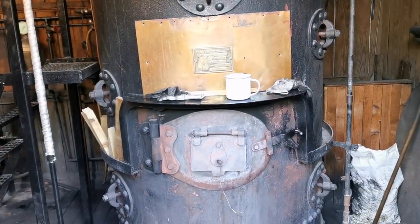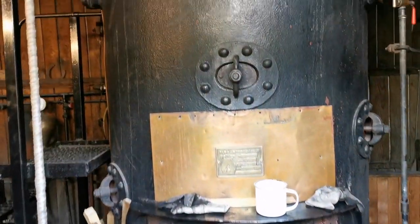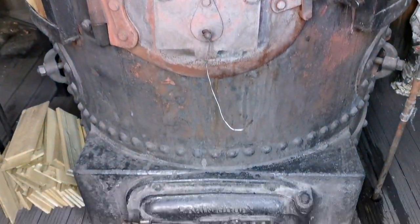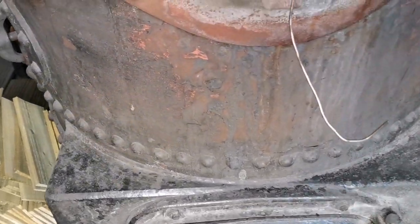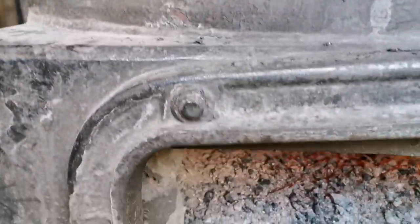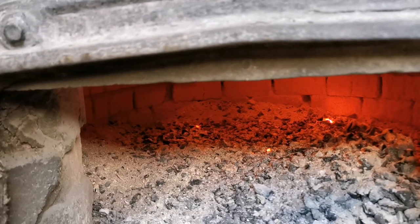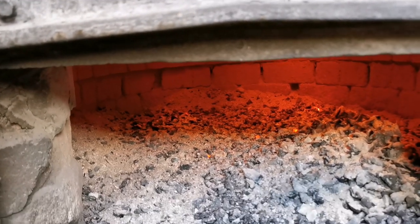Okay so I've swung the camera around now so I can more easily show you bits and bobs. So this is the boiler itself — it is quite a large vertical boiler. Starting at the bottom, grab a glove because it's hot — this is the ash pan. All the embers drop down into there. In fact you can see some dropping through now. Because we're late in the day the fire is now quite low, so there'll be quite a bit of ember dropping down.